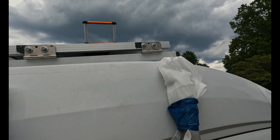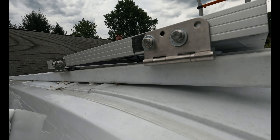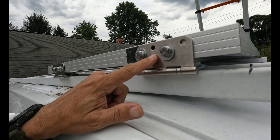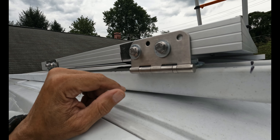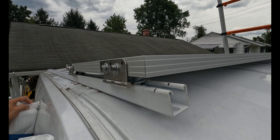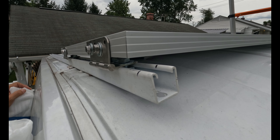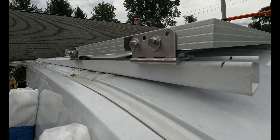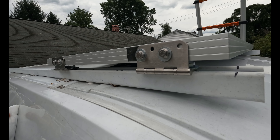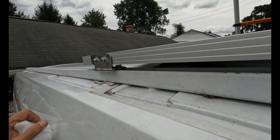Today, Sunday July 31st, I finally got one solar panel up here on the roof. I'll try to point out a few things I did to make this work. Stainless steel hinges, heavy-duty hinges, stainless steel bolts also on this support. It was really hard to drill through those hinges because the holes weren't big enough, but I was able to get them — I think that's a half-inch bolt in there. I put some super sticky tape on here, not that I thought it was gonna work, but at least to temporarily hold it.